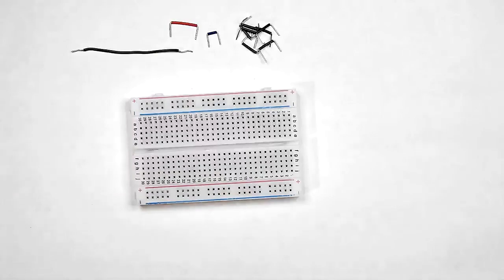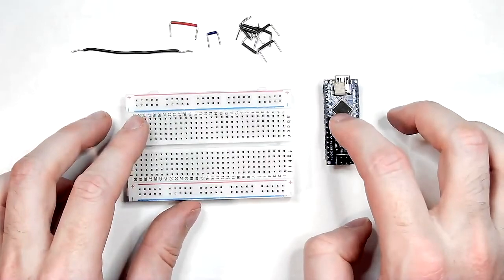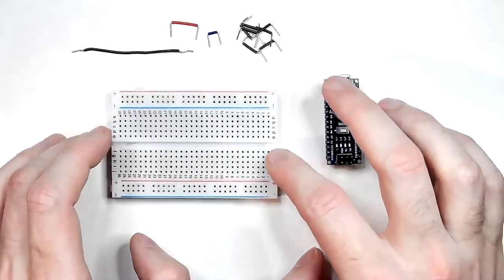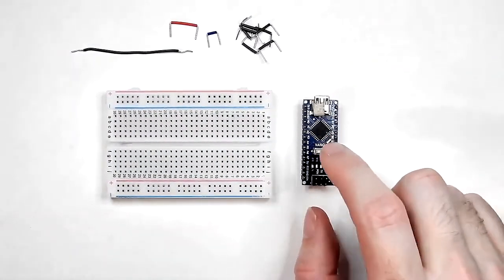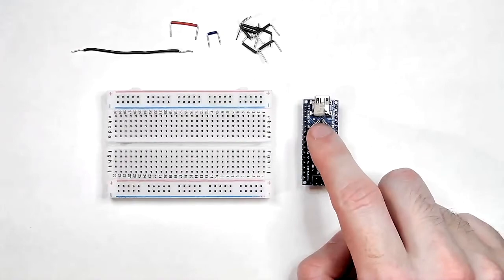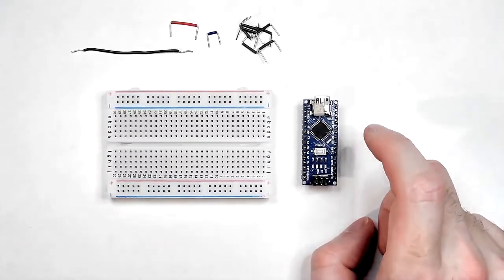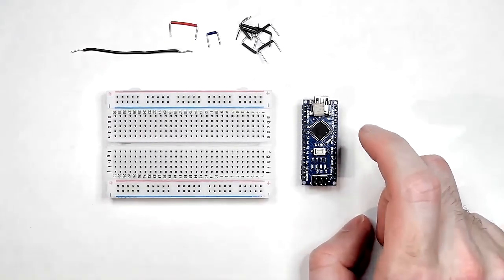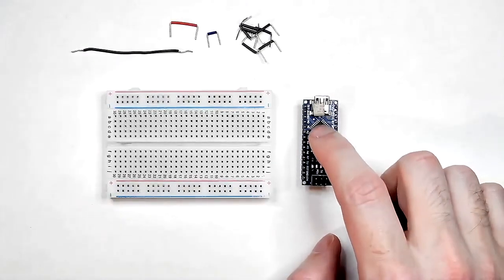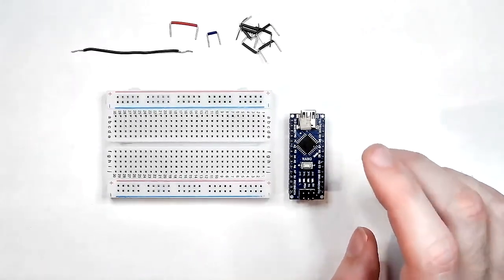We're going to use the Arduino Nano. Now these are clones of the actual proper Arduino Nano. Be warned that not all clones are the same — there's a batch coming out of China that look identical but don't use the ATmega 328P; they use the ATmega 328PB. Unfortunately I don't currently have a way of flashing the compiled hex ROMs to that variant, so you really need to make sure you're using the correct ATmega 328P variant.